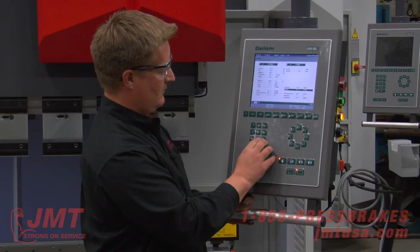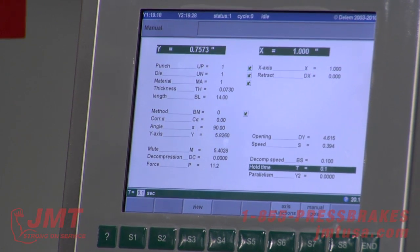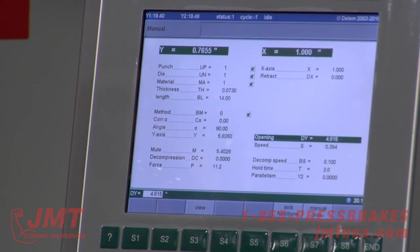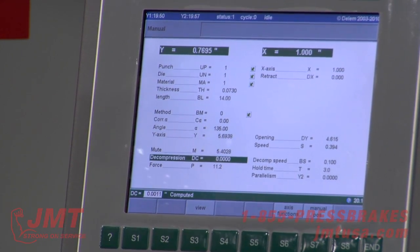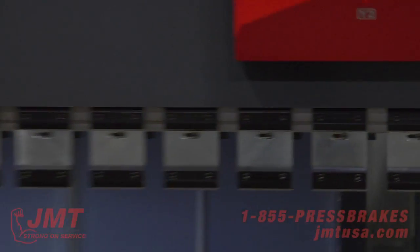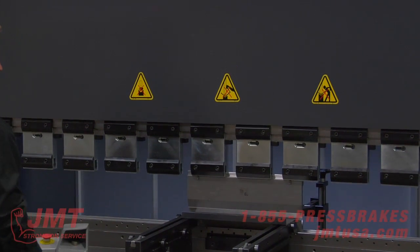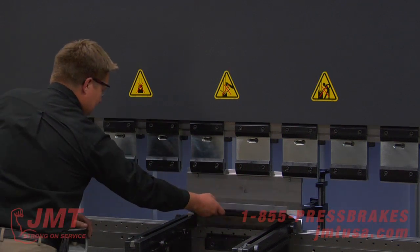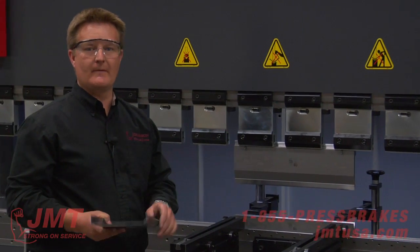I'm going to take that back to 0.394. Now let's do a three-second dwell. Same thing — I'm at 90 degrees, but let's say we don't want 90 this time. I still have my dwell, but I want a 45 degree — the machine works from 180 and subtracts the degree, so 135 is 45. I've got a dwell at the bottom now, and I can see a 45 easily.